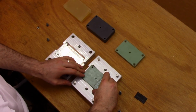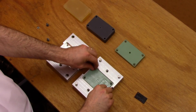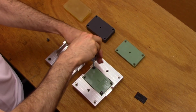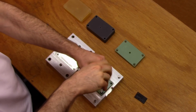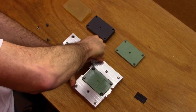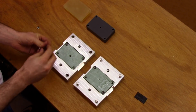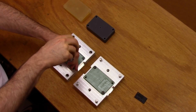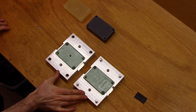The first thing we're going to do is install the clamp side of the mold on top of the rubber — that's just two bolts. On these bolts, just finger tight is okay, just a little snug. You don't want them too tight because you can break your mold. Now we'll install the injection side of the mold, and again just two bolts, finger tight is okay. There you have it — we have our 3D molds inside our aluminum blanks and we're ready to start molding.